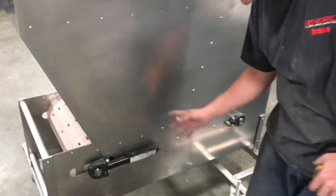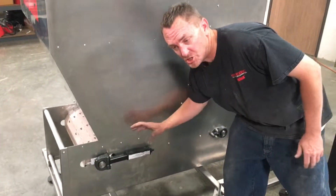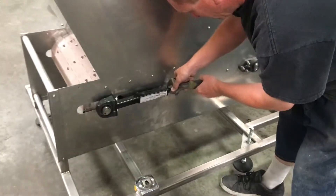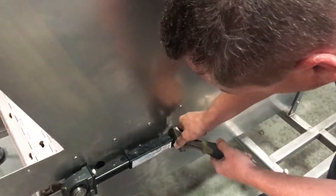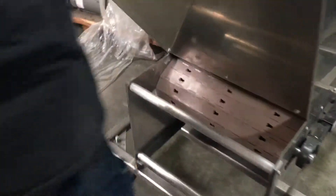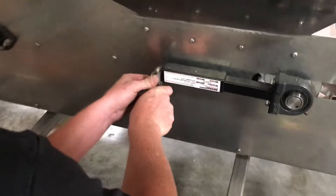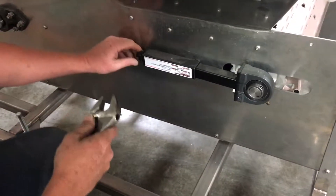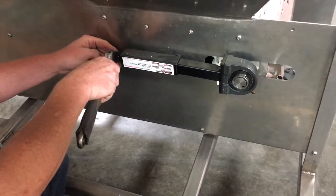The first thing you have to do in order to change these pins out is you have to press the wrench — you have to loosen both of these nuts, loosen the two big nuts on both sides. Then you have to loosen the little one, which is the threaded rod, and pull the take-up and the bearing back.